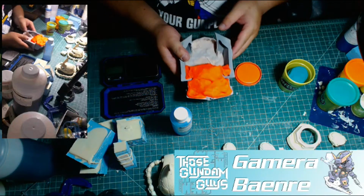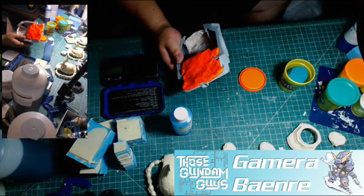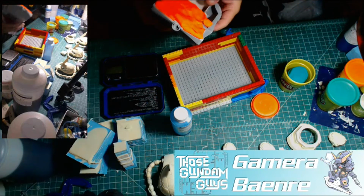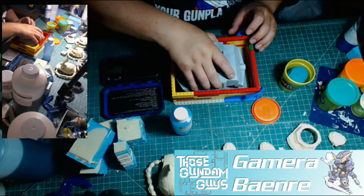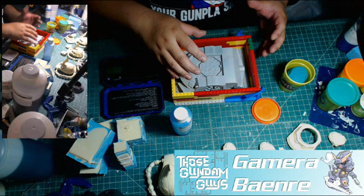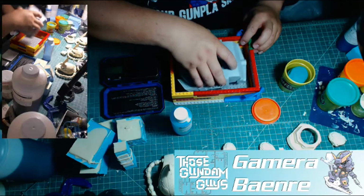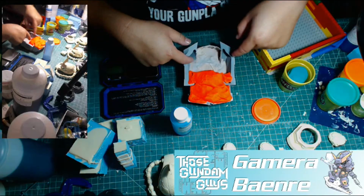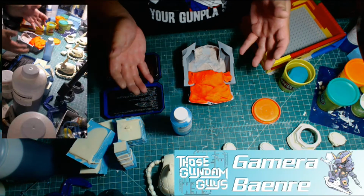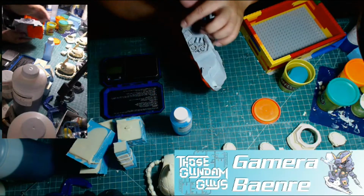So what I'm going to do is make a mold of this. Let's start off with my mold box, right? The idea is I'm going to lay this down here and pour silicone over this, and then do a 2-part mold. This is the first part of the 2-part mold. Right now I'm filling this cavity here because I don't want to waste a lot of silicone when I want to cast just the top half of this, right?